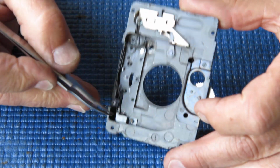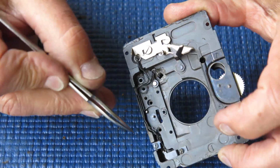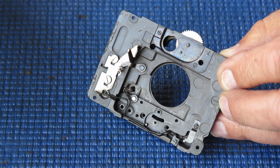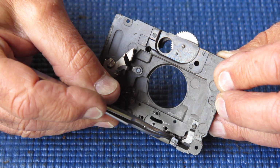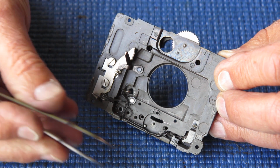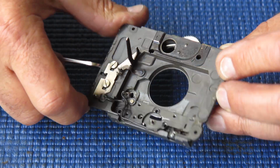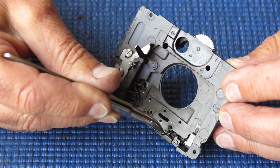Now the flash contact down at this point, these are very fragile. If I hold that right, you can possibly see that there's just a tiny thin bridge of plastic holding the contact on at that point. That's prone to failure. This is already an ugly shape down there. I don't know what's happened there. I think somebody's melted that when they've gone to solder a connection onto that.